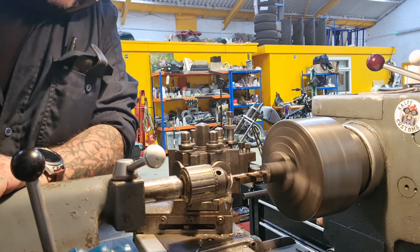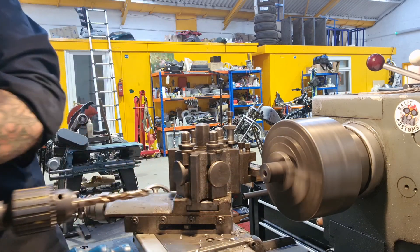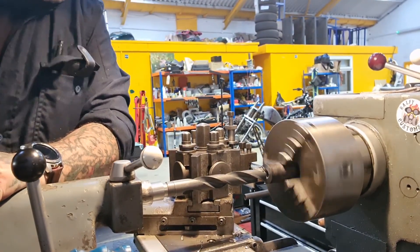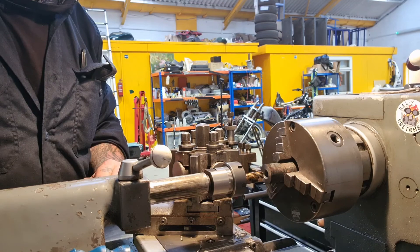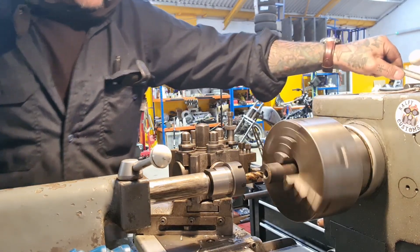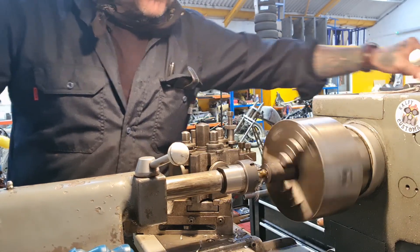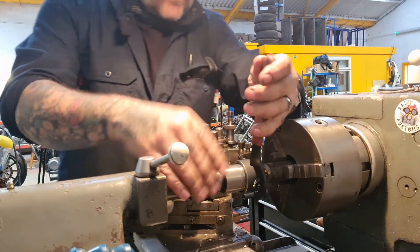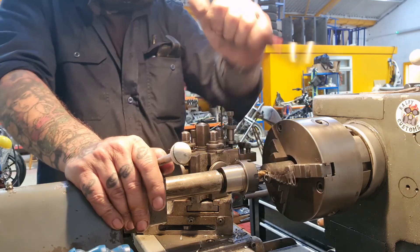It's a 25 long so we won't - say - 30. I've gone 40, look. I'll give that a counter bore, ready to take the thread. Now this should tap in lovely - brand new machine tap - and we'll feed it nice. Here it goes, taking it straight off me, pulling itself in, spinning in the collet - that's unusual. I'll give that a quick tighten down. See what that does.